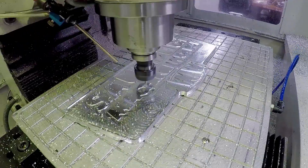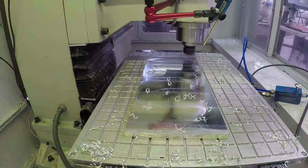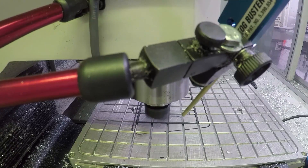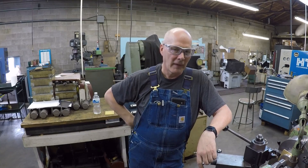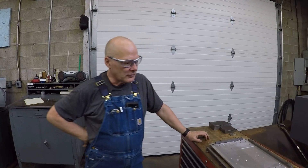If you've got negative tools you could still do it — just know you're going to be cutting slower. We really like super glue and vacuum as well, but the one piece of advice I often give folks is: when you've got a facing operation on a six-by-six plate, put away that two-inch face mill. I'd much rather start with a three-eighths or half-inch tool and take smaller stepovers. On a CNC you can walk away — the smaller diameter puts a lot less tool pressure on it and is less likely to throw the part.